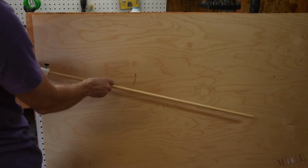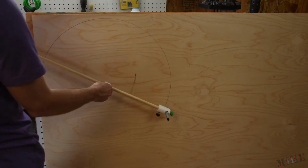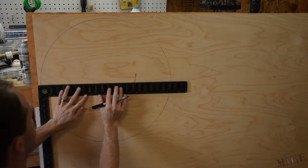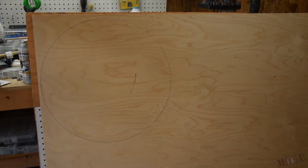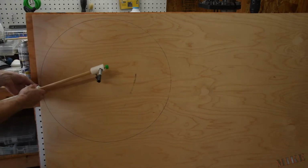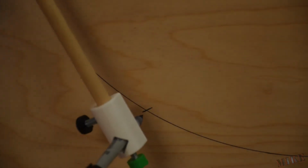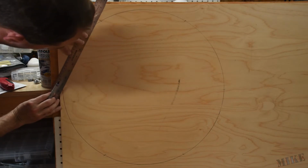And if you remember from geometry class how to make a hexagon with just a straight edge and a compass, I'm going to show you here again. This took a little bit of math because it was the outside circle that I needed, not the inside circle. So after drawing a circle, I mark across the diameter, and then I put my compass back on those 2 points at the end, and then strike little marks on my circle here, like so, as you can see up close there. And then I'll grab my ruler and simply play connect the dots.